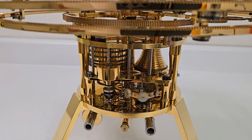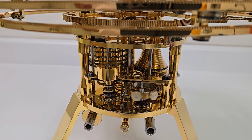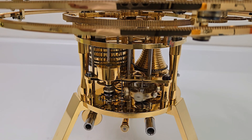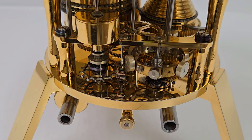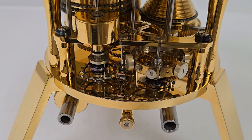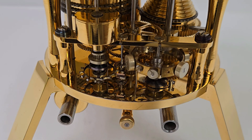The jewel holes and end stones are held in separate bushes. The escape wheel is steel, hardened and ground to size. Considering that some clocks have even counterbalanced hands, this movement has the impossible task of moving over 80 gear wheels. In order to help, it is fitted with a simple constant force impulse mechanism. We're now focusing in on the escapement as well as the constant force impulse mechanism, which is commonly known as a remontoire.